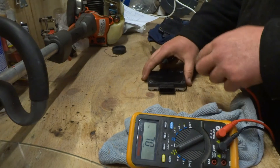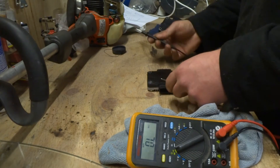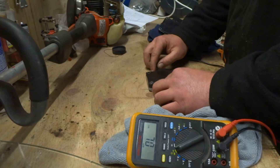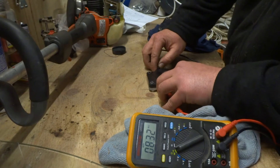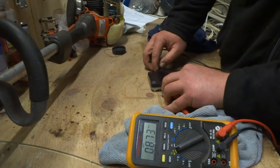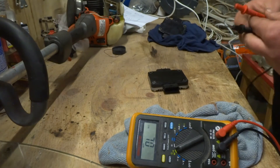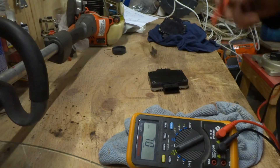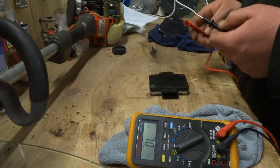Work your way through the pins. For your first test, start with your positive on the base side and your negative on the collector side. You should have resistance — as you can see there, 8.32 mega ohms on that pin and about the same on the others all the way through. You should have some resistance; as the manual says, you shouldn't get zero and you shouldn't get infinity.